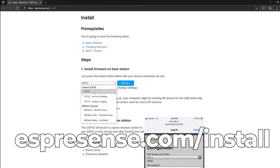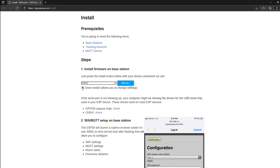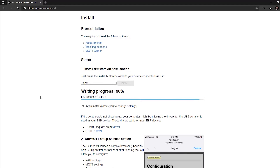To install ESPresense, once confirmed in Device Manager, make sure you're using Chrome or Edge — Firefox is not supported for the web flasher. Select what version of ESP you're using; for a generic ESP32 just select ESP32. I'm ticking Clean Install here — this isn't required for the first install if you have no settings, but if you uncheck it on a firmware update it will leave your settings on the device. Click Install, select the correct COM port, hit Connect, and you can watch it flash right in the browser. This has to be the easiest project I've ever done with an ESP device — you literally don't need to download anything.